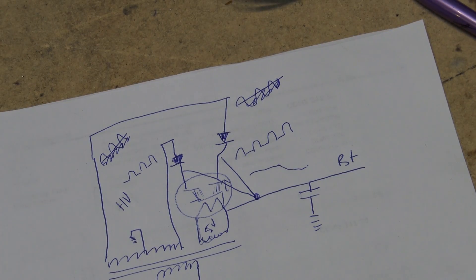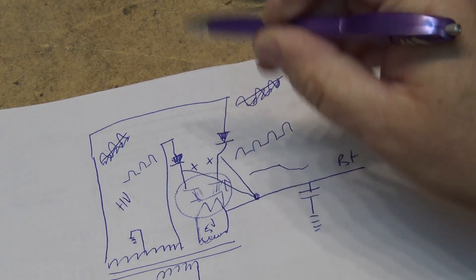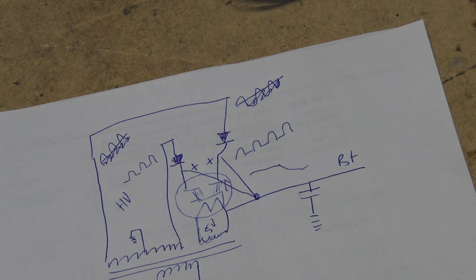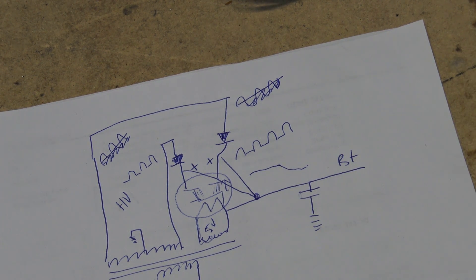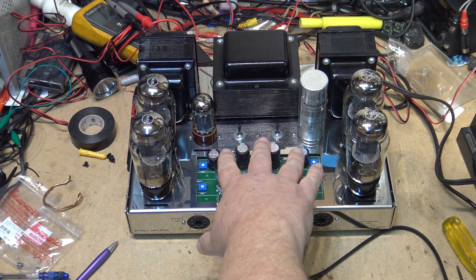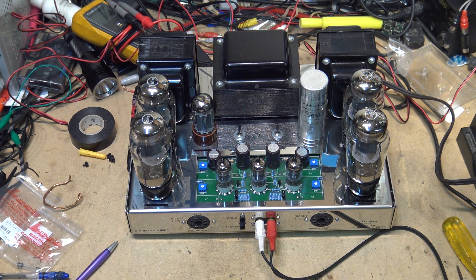This is still wired as a vacuum tube rectifier — we're just giving the tube a little protection. The plates are only going to see positive voltage now; they won't see the negative voltages that were causing the arc-over. The high negative potential was overloading what the tube was capable of, and it affects TungSol more than others because TungSol doesn't have quite as high a rated voltage, combined with the grid now being higher than it was in the 60s. The unit is all back together, ready to go. The client is going to be thrilled — a full set of new output and rectifier tubes, everything biased, balanced, and matched for the best possible sound from this little Dynaco ST70. Thanks for watching, catch you in the next one. Bye for now.